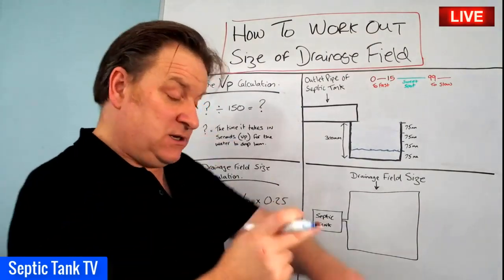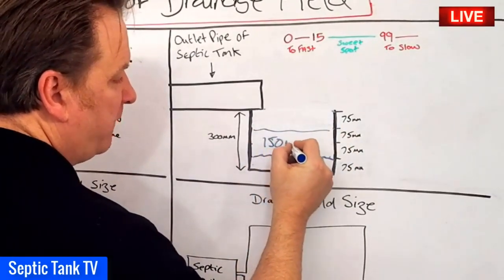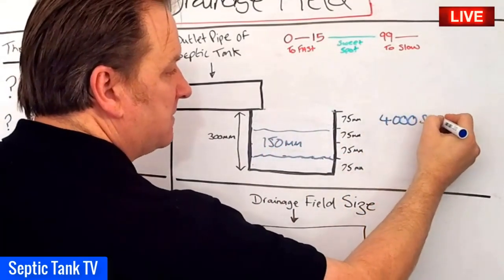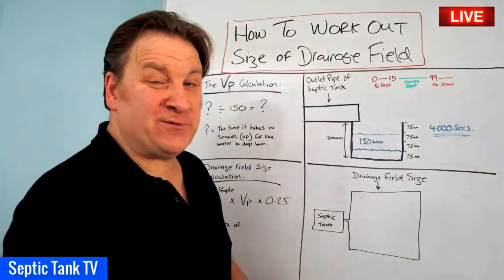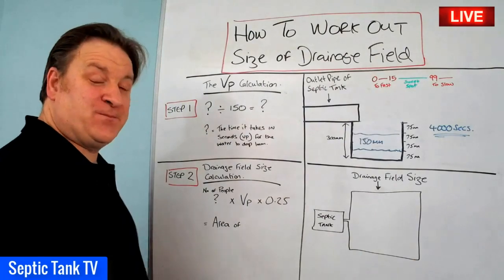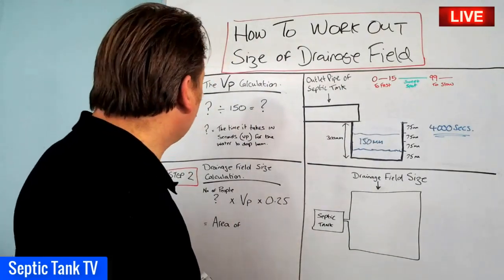So let's say you've done your stopwatch and the time that it's taken to drain 150 mil equals, let's say, 4,000 seconds. It took 4,000 seconds to drain away. That's a very important figure, and I'm going to show you what you do with that figure now. So then we go over to here, because what you've just done is called a VP calculation or a percolation test.